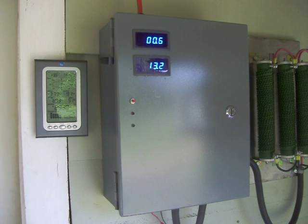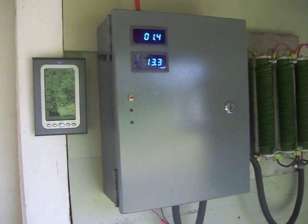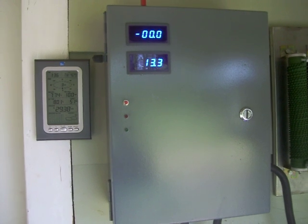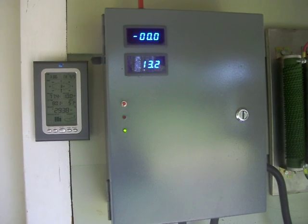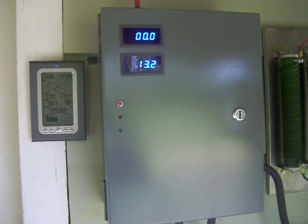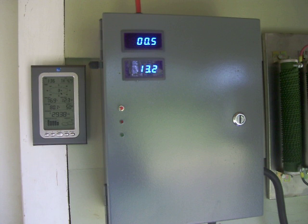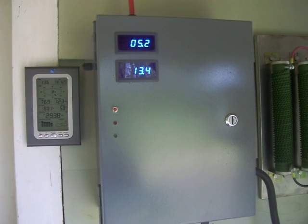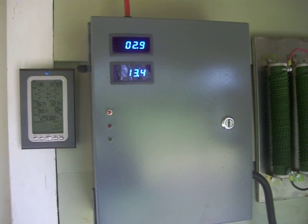So far what I'm seeing is it does better on the DC side. We got a nice windy day today. Right now it's not going to put out any amperage, but the dump load has been kicking on and off all morning long. I was watching it earlier — it's actually hitting about 29 amps, which I thought was pretty good going through one little scrawny 12 gauge wire.